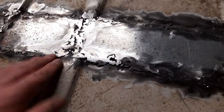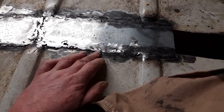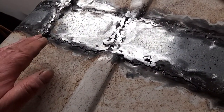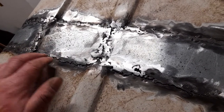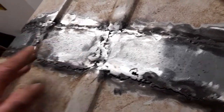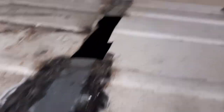Then I can ram body filler across that and you won't see it. However my main concern with repairing the roof, as I said in the last video, is water seeping in here and getting down inside the vehicle. So if Chris does come out, we can get him to tack some seams along and hopefully make it watertight. What I'm going to do before I finish is pour maybe petrol, turpentine, or some kind of solvent to see if any runs down through it. Putting fibreglass over the top and that roofing flashing bituminous material will help get it watertight, but I'd rather the weld be watertight.